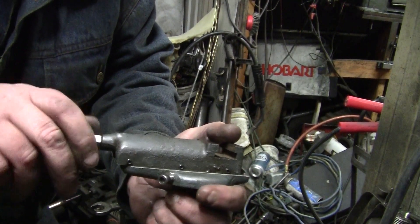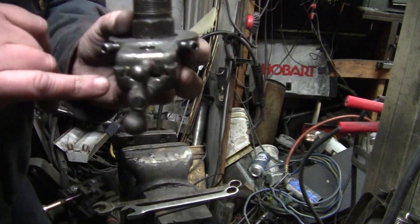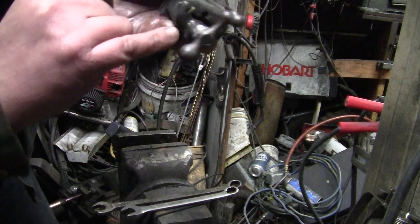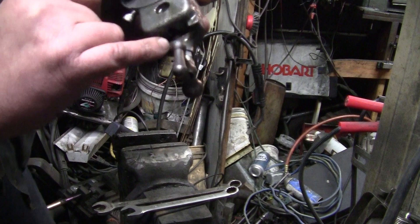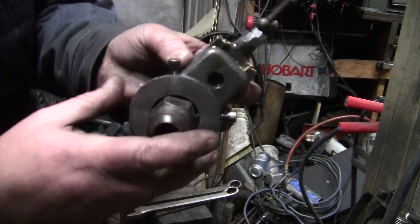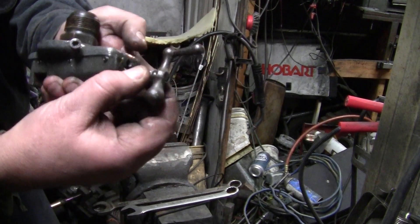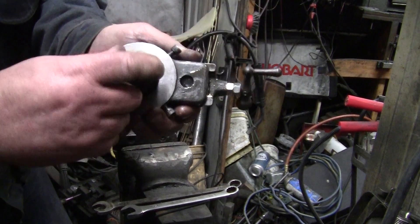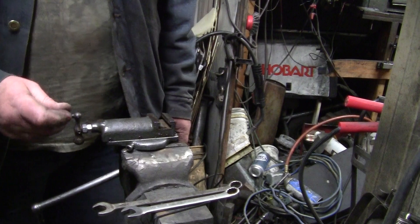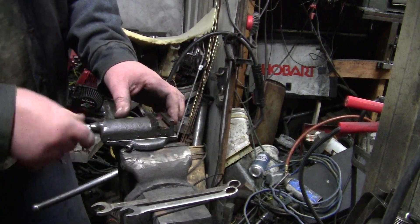She runs like butter. I did put a brass bushing inside the sleeve — the casting — with brass. I made a new brass gib; I don't know if you can see it right there. I made a brass gib, put all new gib screws along here. This is adjustable now — you can take up your slop. She runs like butter, very nice. The play is like nil.